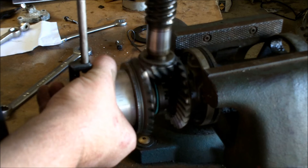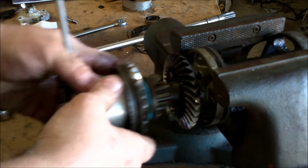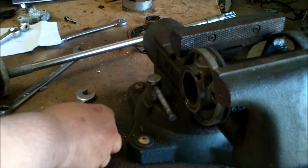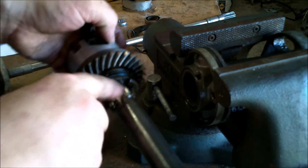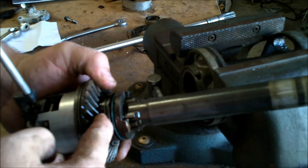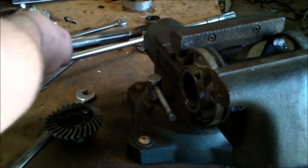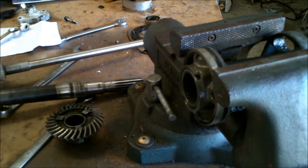Now the prop is in reverse. The way this clutch dog works — the pinion has dogs on it, or I guess you'd call that a spur gear — and the clutch dog itself is splined to the shaft right here, and it is always constantly meshed with the shaft. When this thing is in neutral, it disengages from the forward gear and the reverse gear and is by itself. If you have any questions on how outboard motor lower units work, let me know. More Medic One.